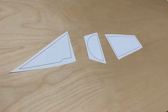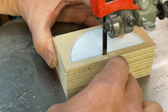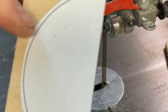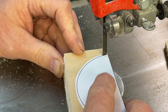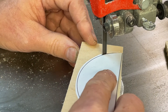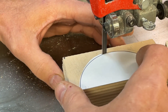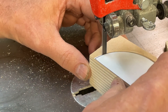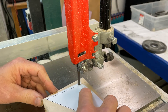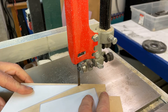I take my bandsaw and hand-cut everything. Many people have reached out saying I must be using a laser cutter, but you can get really good cuts without one. I've sped this up a little bit, so please take your time. Understand that blade can cut your finger off — if it gets you in the wrist it might hit an artery, so be really careful. You can hit the edges lightly with a sander to clean things up.